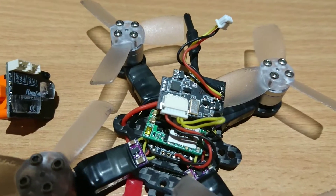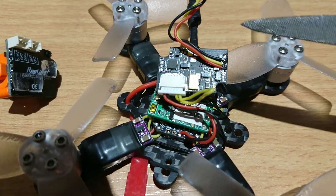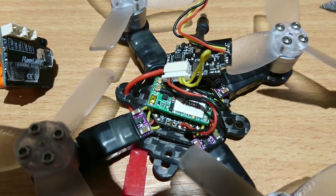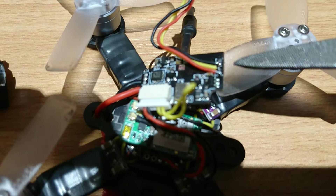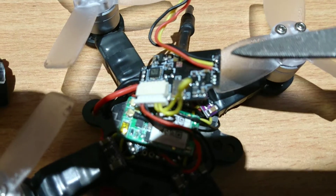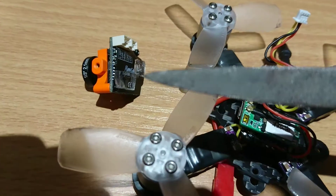What you'll be looking at is: the bottom pin of the four, with the aerial at the top, is VCC — it basically outputs whatever voltage you're putting in at the bottom, which on the Babyhawk is obviously five volts. The second pin up is your video input to the VTX, and the third pin up is the ground for the camera.